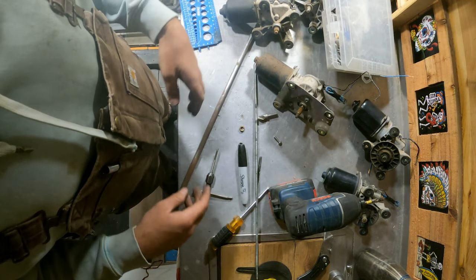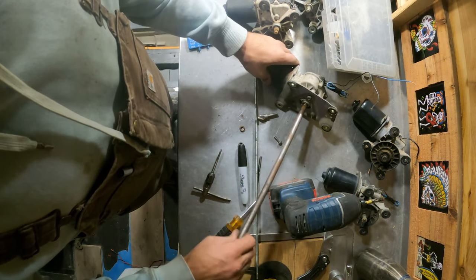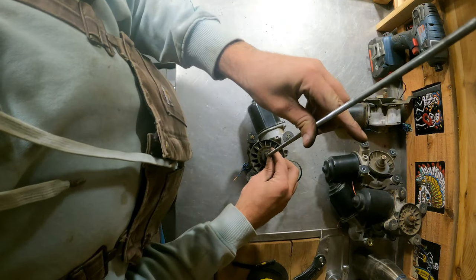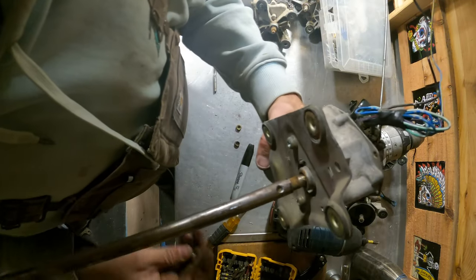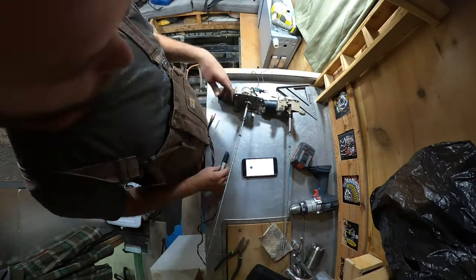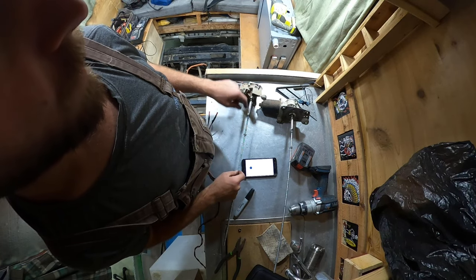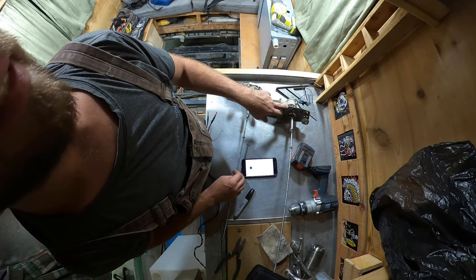My first job was to try to couple a lead screw to the shaft of the motor. Normally you can buy couplers on the internet for this kind of thing, but they're expensive and I live in Mexico so they're not so easy to get. So I decided I'd make my own. I had some cheap threaded rod — about 1/8-inch thick — and first thought that might be sufficient. But I was wrong. After using some tubing and careful welding I got the shaft to spin, but the travel speed of the bolt was super slow: 23 seconds an inch on one and 21 seconds an inch on the other.